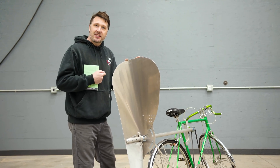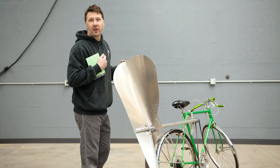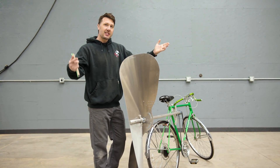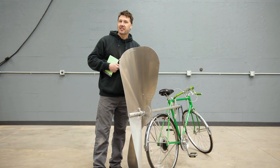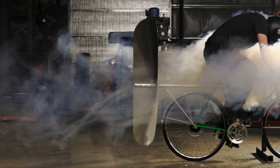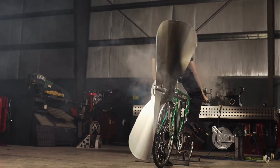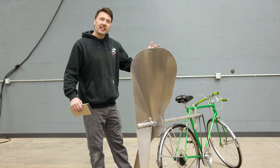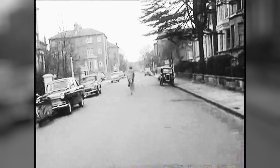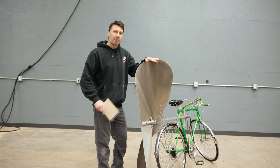I'm going to open up the opportunity for you guys to help participate in designing a better propeller for self-powered flight. I'll be doing some of my own testing and I encourage you guys to submit your own. All you need to do is build a propeller no greater in length than four foot six, that can slip over a three-quarter inch shaft. I'll leave a link in the description where you can email me and submit your propeller. The requirements are: it needs to spin about 400 to 500 RPMs, and it will probably need to generate wind speeds up to 20, 25, maybe even 30 miles per hour — and it needs to be pedal powered. I'm not going to gear up the bike to make it go faster; it's got to stay just like this. Ernest's design turns at about a four-to-one gear ratio, which is almost exactly what I have here. Please submit your ideas — and don't submit engineer drawings, I actually want to see a propeller, because we will test it on the YouTube channel.